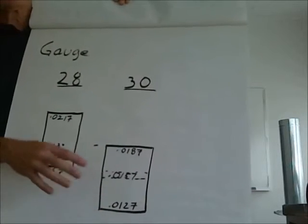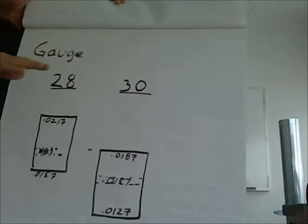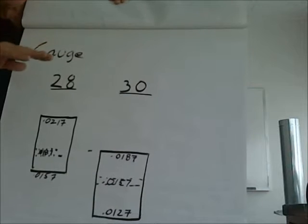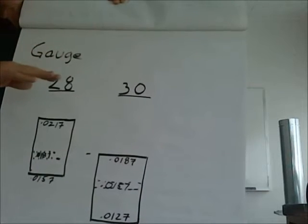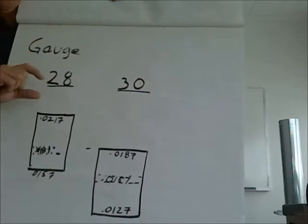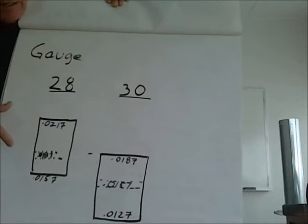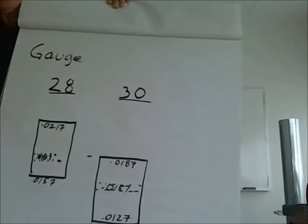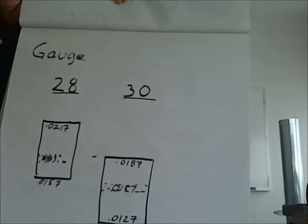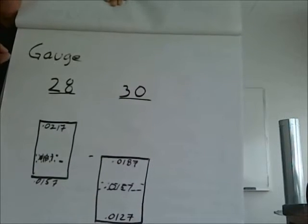That's because when they take the hot metal and roll it, sometimes there's a variance between the axis of the rollers, and they kind of move up and down. So the international standards give a gauge for a range. And of course, as you go to 26 gauge, 24 gauge, and 22 gauge, that's thicker. So you've got to think the smaller the number, the thicker the gauge.